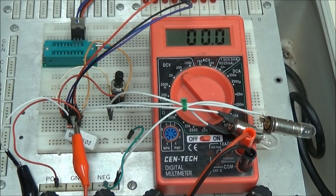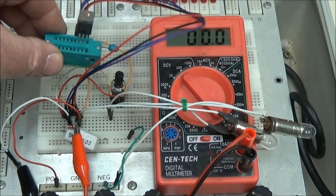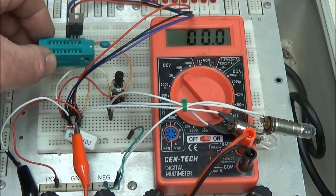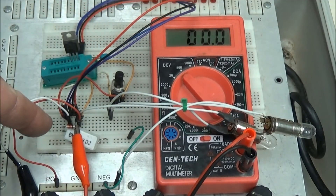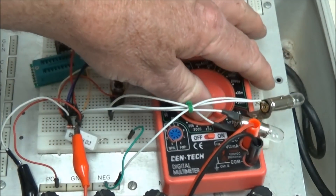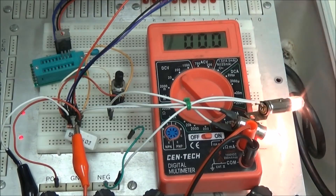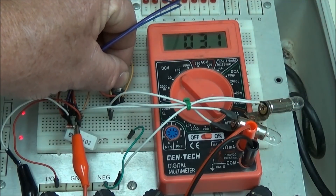The discussion here is going to be how to check the turn-on voltage for MOSFETs, be they P-channel or N-channel. I'm using 50 volts from my test console. This is a little zero insertion force socket I set up for changing MOSFETs or whatever I'm checking in and out. It uses a 50 volt power supply, a potentiometer, a 12 volt Zener diode, and two 12 volt lamps. All you have to do is switch on your 50 volts and adjust the potentiometer.